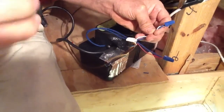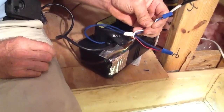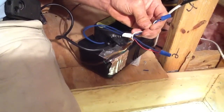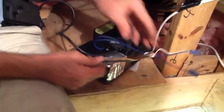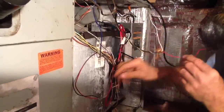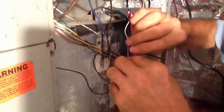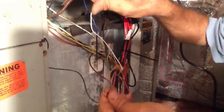It works just like an SS2 or SS3 switch for you technicians — nothing more. You're only going to break the red wires: the one that comes from the thermostat and the one that comes from the air handler. I've used my red and white here — I'll straighten all this up later, this is just for demonstration purposes. Here's my red from my air handler right here, and here's my red from my thermostat right here.